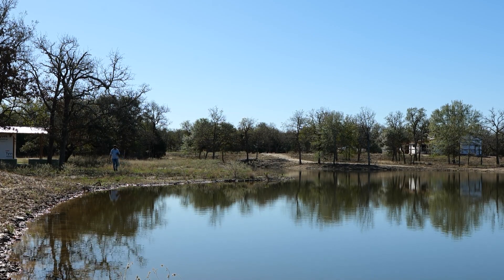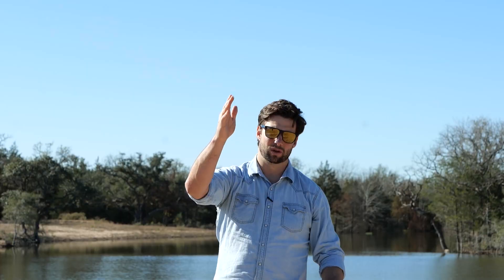These two spillways act in tandem with each other. The north one sets the height and is the initial normal spillway that carries all of the normal flow of water from upstream. The southern spillway is our emergency spillway that gets utilized if we have a big rain event — when the pond's all the way full and we have to dump a lot of water back into the drainage ditch behind the pond, under the culvert, and on downstream.